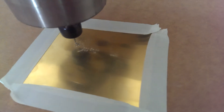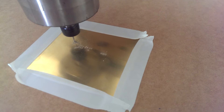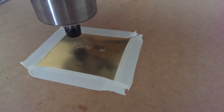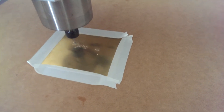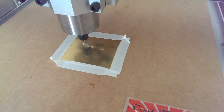The double-sided tape stops it from popping up and creating bigger holes for the solder paste. We've done this upside down so that the very tiny angle on the engraving bit will face down toward the board, so the solder will actually stick more to the board and not be lifted up. I'll show you more when it's done.